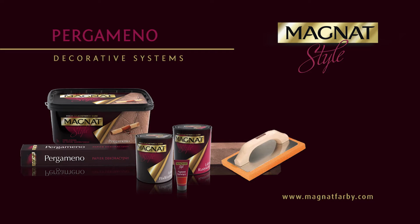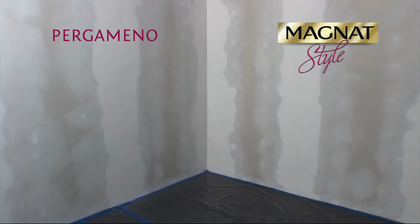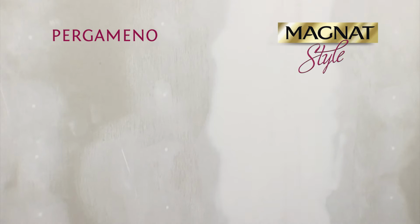Substrate preparation. Proper substrate preparation is a critical stage of work. The surface to be rendered with MAGNAT Style pergameno should be solid, dry, and free of dust, adhesive residues, oil, grease, or grime. Apply only one coat of MAGNAT Style undercoat with a roller.